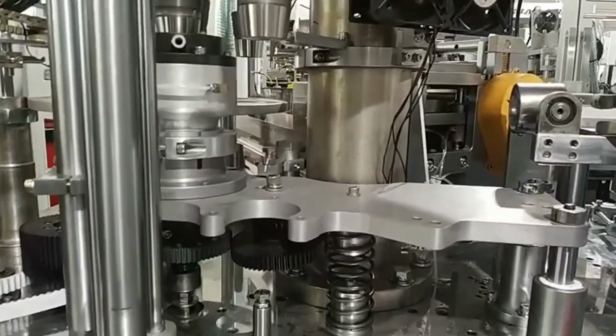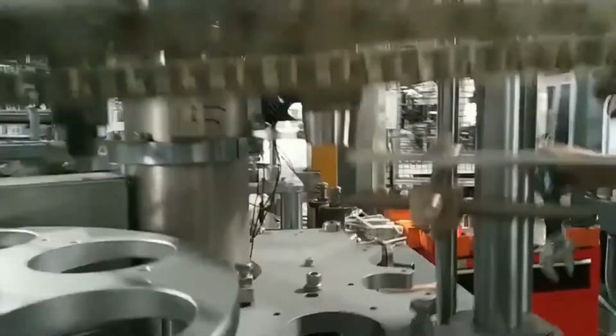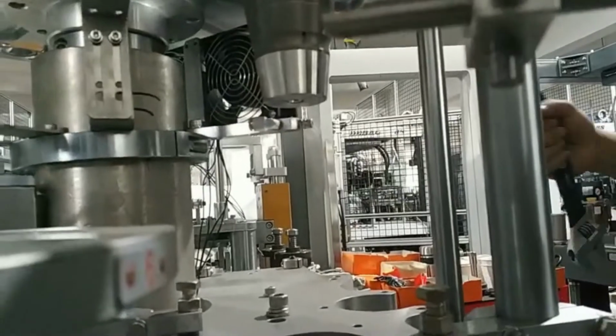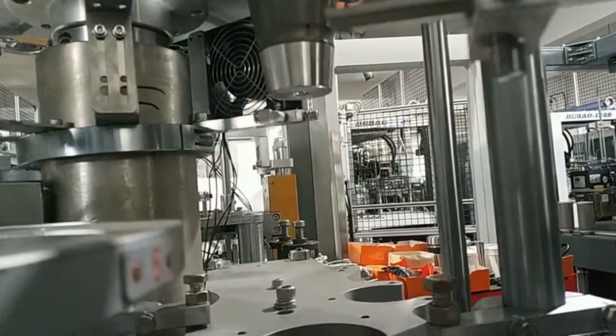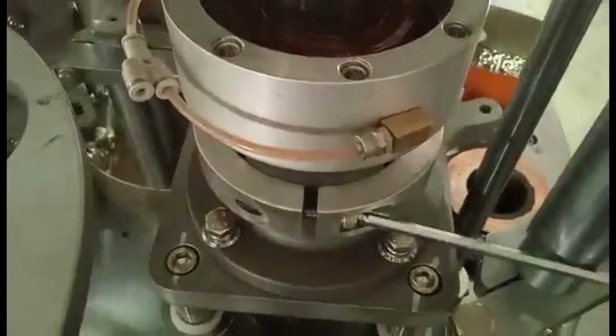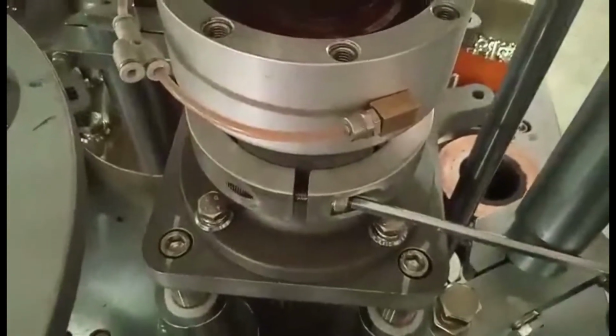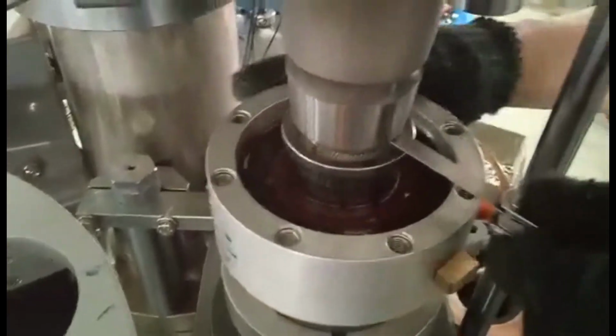When the heating board raises, we first adjust the height of the pushing out board. Then the bottom of the pushing out board is the same as the bottom of the mold. Tighten the adjustable nut on the board. Take out the protection of the knurling tool and the screw on it. Turn the knurling device clockwise to go down and anti-clockwise to go up.